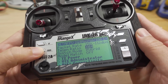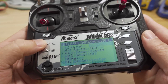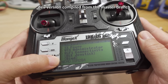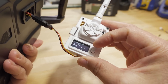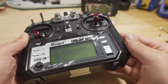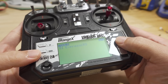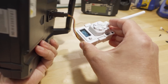You can see here I've got the ExpressLRS LUA script — this is the version 2 LUA script — running on here with a BetaFPV Micro TX. This is using something like version 2.01 from the master branch. I got the button and joystick to work under that version. The radio is reading 5.9 volts and it is powering both the radio and the module. I'll also show you how I wired it up.